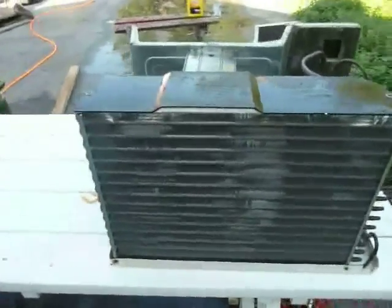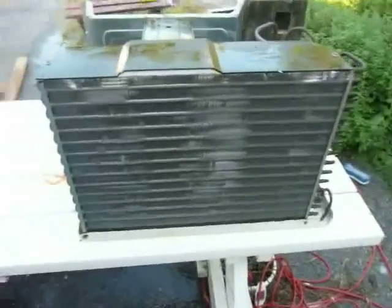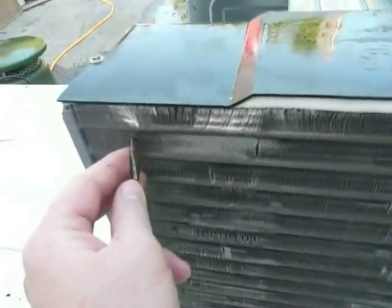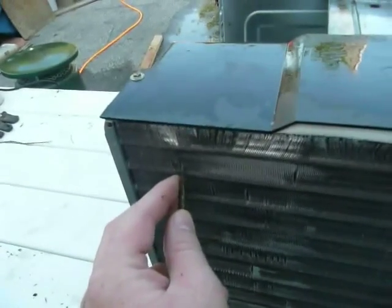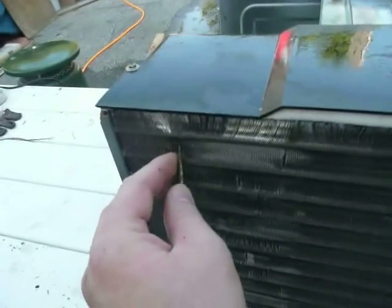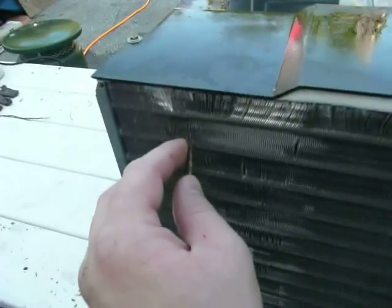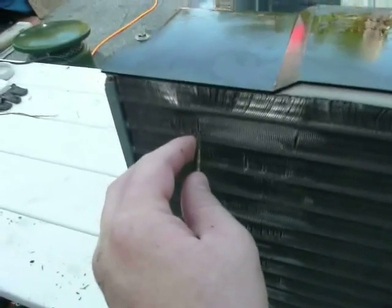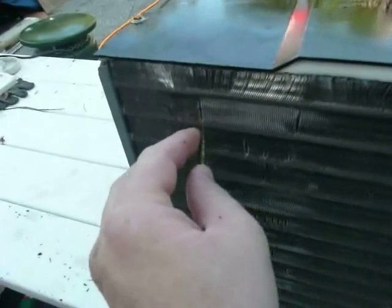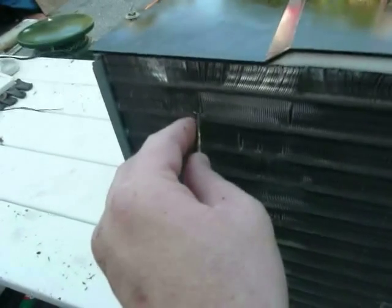When you think you've got it clean enough, it's time for that dreaded part: straighten out the bent fins. As you can see, this unit has quite a few of them. Anyone planning on vandalizing an air conditioner with exposed fins should not do it, because the people who fix them want to hurt you. The idea is you just start where the fins begin to bend over and very, very gently and delicately straighten them out so they're kind of standing back up. I doubt you can get them to look like they did from the factory, but you should be able to clean them up quite a bit. The more of these you straighten out, the better your air conditioner is going to be at shedding its heat into the outdoors and the cooler it will keep you indoors. You'll also be able to clean your coils better if you straighten up all of these that are messed up. On a unit with an unprotected condenser coil, this might take you anywhere from 30 minutes to an hour, depending on how thorough you are.